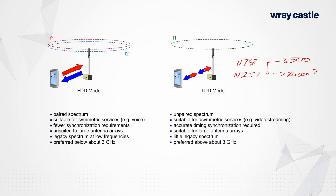This is probably quite good because TDD could be argued to be a more efficient way of using the radio spectrum, not least because you can tailor the uplink/downlink resource allocations in a much more efficient fashion. Where you've got very uplink-heavy services, you can configure the sharing of that radio channel accordingly.